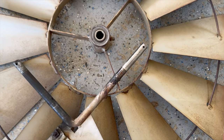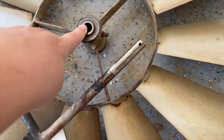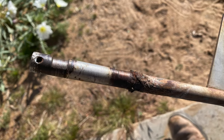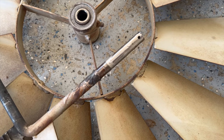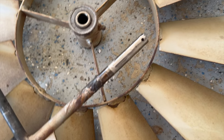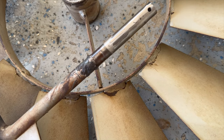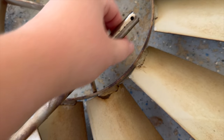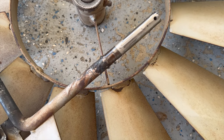was and is this shaft. Basically the bearing was wearing a notch in here, and so the whole thing was wobbling, and it was getting worse and worse and worse. So I was trying to find somebody who could weld it, and I figured we'd just weld a new shaft on, but the person who wanted to weld it, just some person on Facebook, decided they wanted to fill it in and then grind it down to make it flush, and it worked.